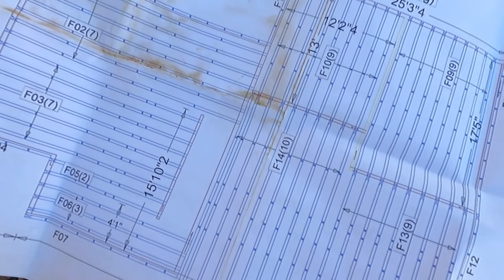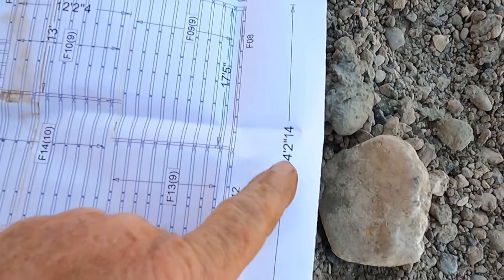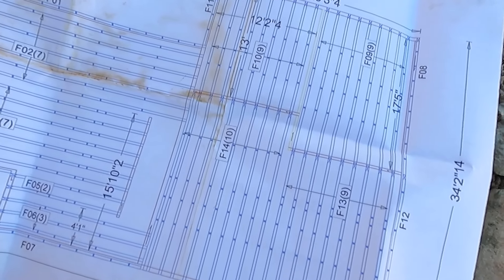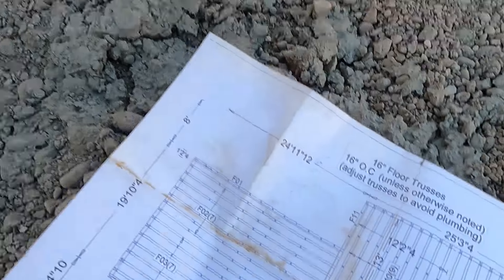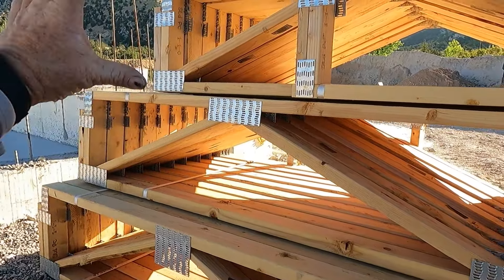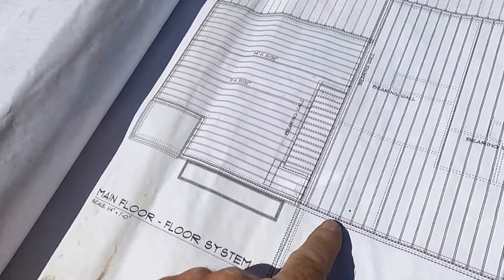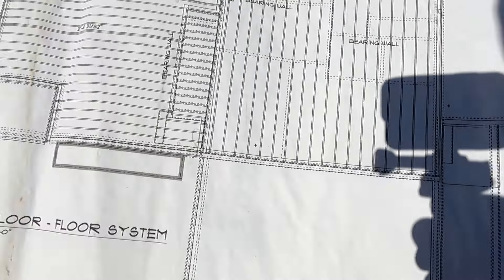That's the information we're working off of. I measured the foundation and gave them all these numbers — that's how I got the floor. I didn't dare order without measuring off my foundation, because when these are wrong it's really bad. You have to cut all the gusset crap out; it's a nightmare. If you're doing floor trusses you've got to be on the 16th of an inch.